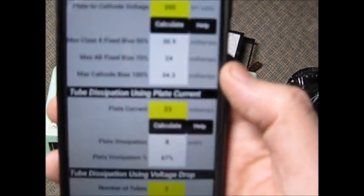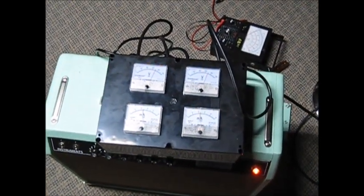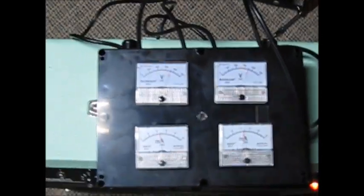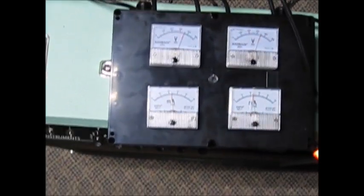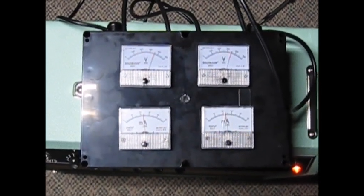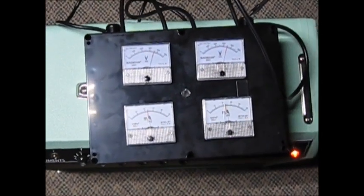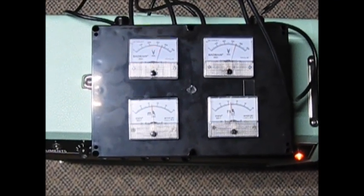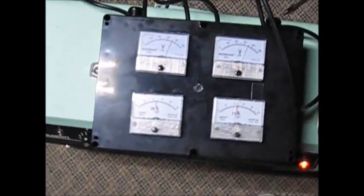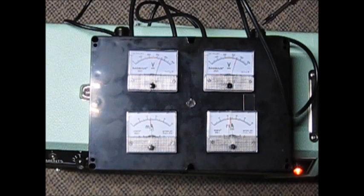So how did I make this? I'm not going to give you a detailed extreme how-to, but I will show you a couple of things. The concept is I need to be able to do both octal tubes like your 6L6 and 6V6, and also EL84s for the Vox amps. The Weber bias rite shows only current and not voltage easily in front of you. I don't know if they still make the Bias King anymore — all the ones I could find on AliExpress were current only, or just an adapter you had to stick on your meter.